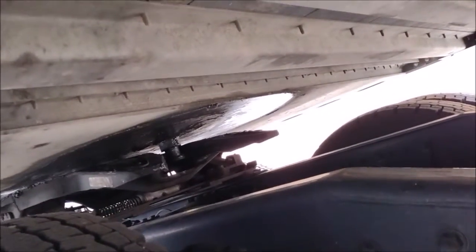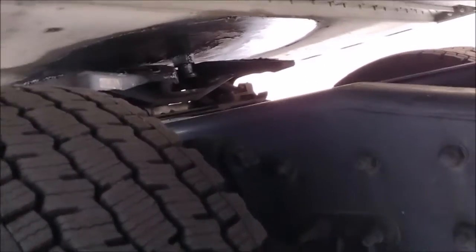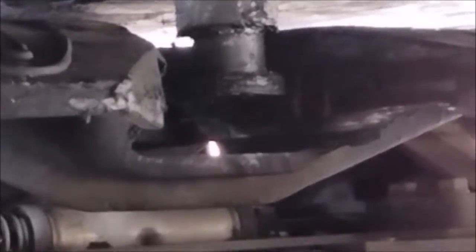Inflating the airbags here with the kingpin close to the jaws is a very risky business. You have to make sure that when the kingpin and the airbags are inflated, you don't ruin the fifth wheel. As you see, there is a layer of air, a separation between the fifth wheel and the trailer, and the airbags are deflated.